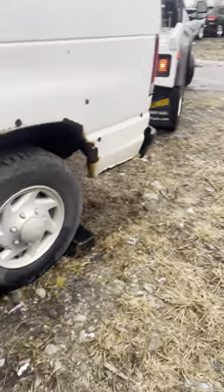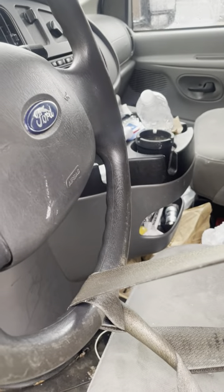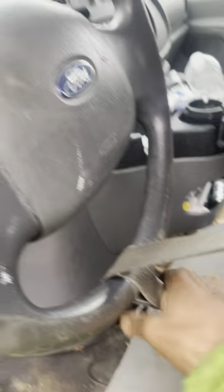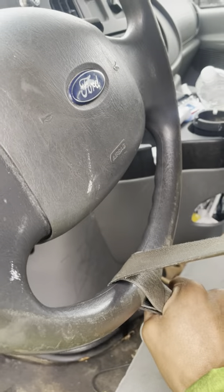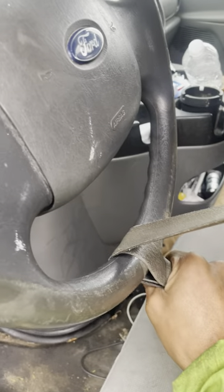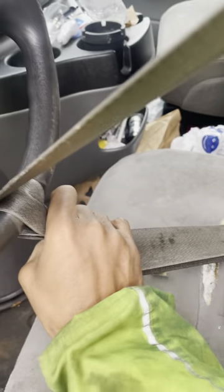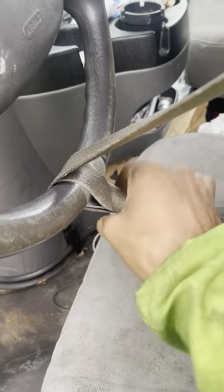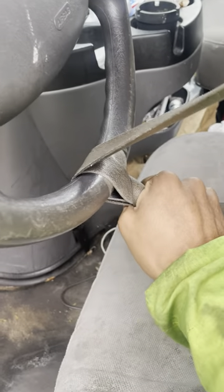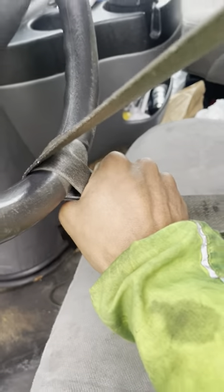They could say the ring wasn't tapping before you picked it up, and then you picked it up and let it roll. Another advice — I've been hearing somebody say they're picking up cars from the back and pulling them, which you can if it's a front wheel drive car. But there's a high, high, high likelihood chance that you're going to burn out their trans. I've also seen it done and heard about it — you can put the car in neutral, start it, and let it run while you pull it.